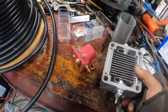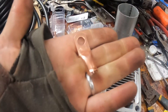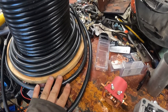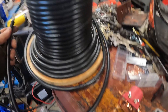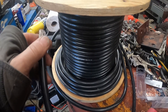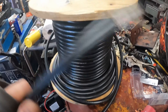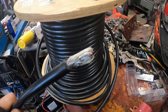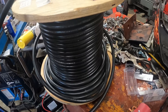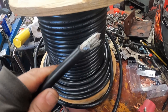So what I have is the grid heater, a relay to drive it, a bunch of connectors to make up the right cables, and a bunch of wire. I got the wire at a lot at an auction, which is why I'm using ridiculously nice wire. I have two gauge and eight gauge wire, and the ampacity chart says four gauge is what I need. So when in doubt, go up a size — and it doesn't cost me anything.